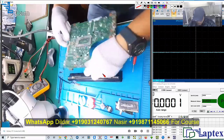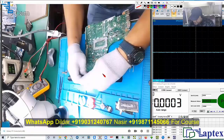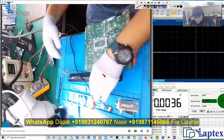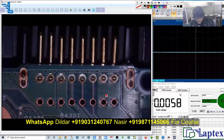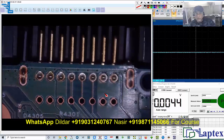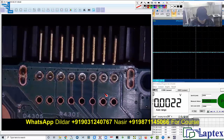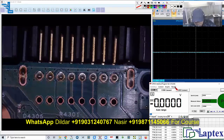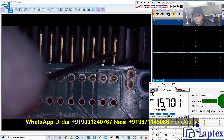Let me insert the battery into the motherboard. Turn the board — somebody has tried so hard that the plastic is damaged. Good effort. Now I have injected the DC jack into the motherboard. Let's come and check. The motherboard is now with the battery. I'm just checking the voltage. The battery output is having 15 volt — that is good.